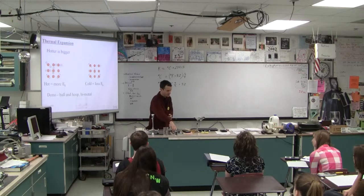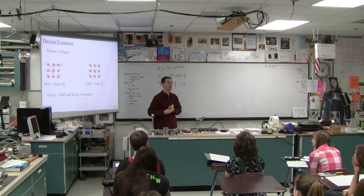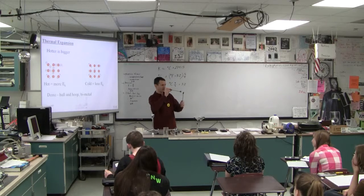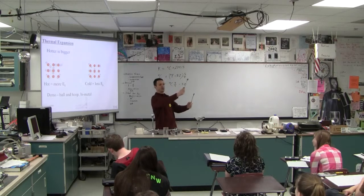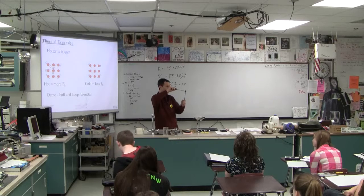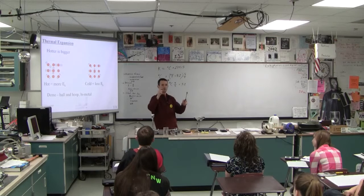Blacksmiths use this thing. Have you ever heard of cold riveted steel? This is something that maybe people heard more about when there were a lot more rivets in our lives, right? The idea is that you take the rivet. A rivet is like a little nail that joins pieces of metal. You cool the rivet down, and then if you can, you heat up the hole. They just barely fit together, and that's the way rivets work. When the hole cools down, it tightens up on the rivet, and the rivet expands, and then the rivet can never come loose. Kind of a thing, right?